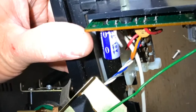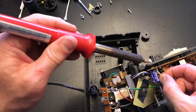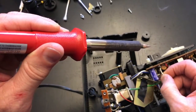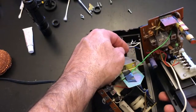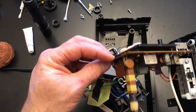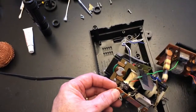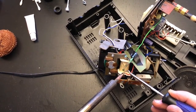We've got a blue wire, a gray wire, and a white wire that goes over beside that capacitor. You have to be careful because there's lots of plastic there — just carefully desolder it and it comes right out. After desoldering those, you work them through. I discovered the green wire has to come out too. I decided it's best to desolder it down low where it picks up power rather than risk destringing the tuner.